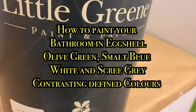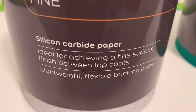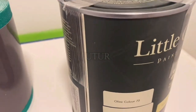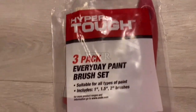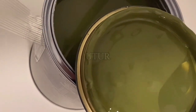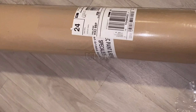This video shows you how to paint your bathroom in Intelligent eggshell olive green, eggshell white and smalt blue. If we're not happy with one of the eggshell colours, we can repaint it by prepping the wall with an 80 grit or 180 grit sandpaper and then repaint it with an eggshell scree grey paint. I have a 1.5 and 2 inch brush set — you can use them if you're working on a budget, but I prefer the synthetic bristle ones. Check the link in the description for an exhaustive list of masking and painting tools.